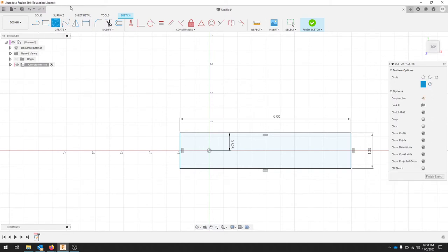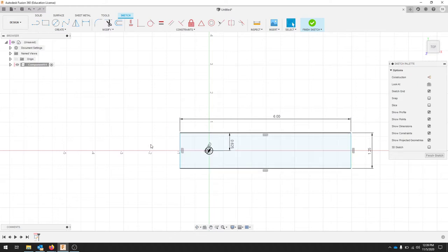We're going to set a slot and a circle inside of this clamp. On the back end, I'm going to use a 5/16ths to prop up the clamp so it can be used for a thicker stock — just a tapped hole in the back tapped directly into the wood. We'll make this 0.257, a little larger than the quarter inch end mill we used to cut out this part. We'll also make sure that that's the right dimension for tapping a 5/16-18 bolt. We'll set the distance from the hole and make sure that it's about three quarters away, giving enough meat around the hole.